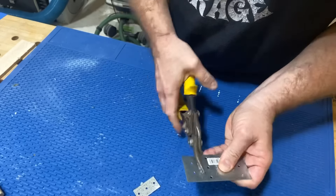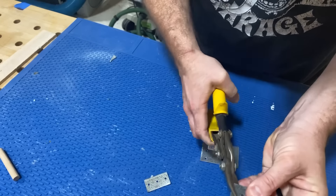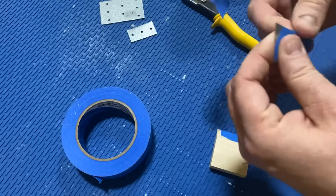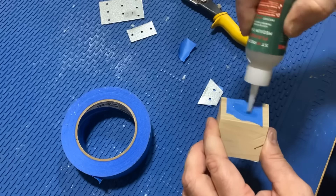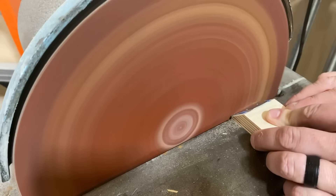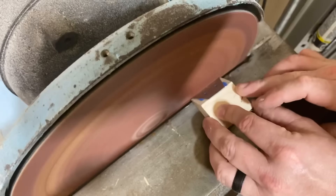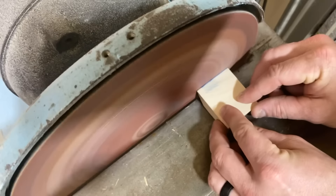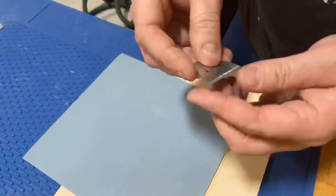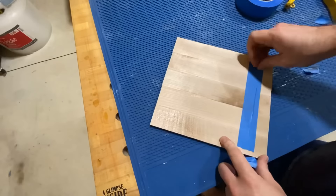This is my attempt at making a metal cutter out of some dimensional lumber joist hanging material. What I'm going to do is cut out with tin snips a piece that looks like a utility blade. I'm then going to use blue tape on either side and some CA glue to stick them together so I can peel it off — it's actually a pretty cool CA trick. Then I'm going to take it to my disc sander and sharpen one edge. With that edge fairly sharp — not razor sharp — I was able to take it off with the blue tape. Then I'm going to sand everything flush, and this will be the edge mounted on the front of the tape dispenser to cut the tape any length you need.